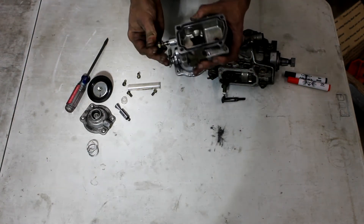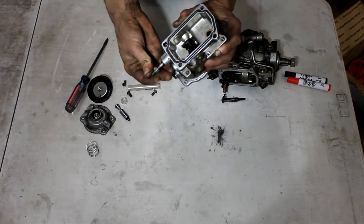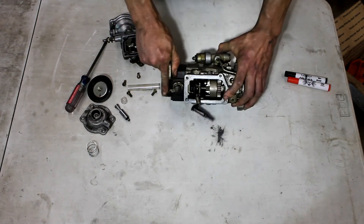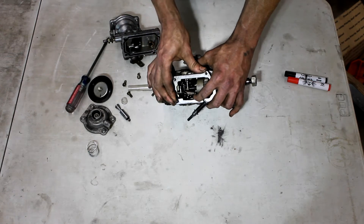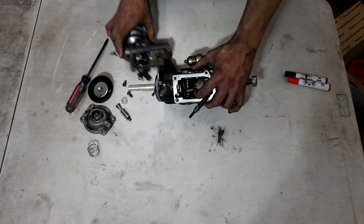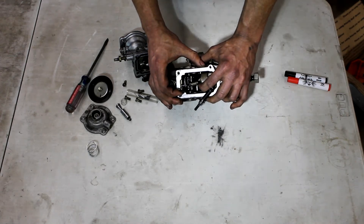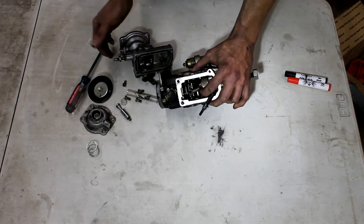When putting it back on the pump, this metering screw needs to be all the way out because the nub will protrude through. If you try to put it on with the nub sticking through, the fulcrum lever with the top off sits all the way in the back position and you will try to tighten it down with the bolts and break it off. It's not easily weldable material and you'd need a TIG welder - so just back it all the way out to avoid that.